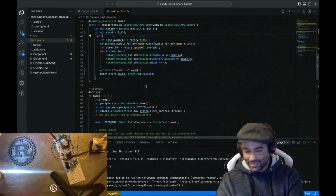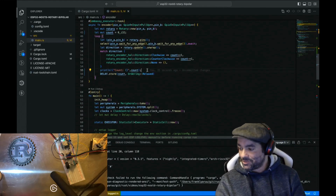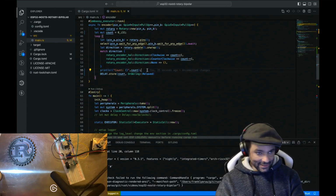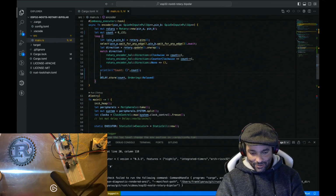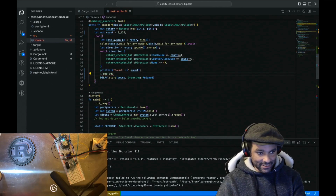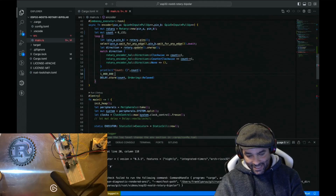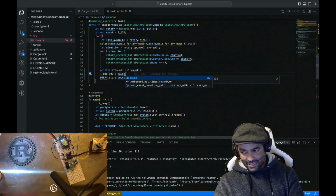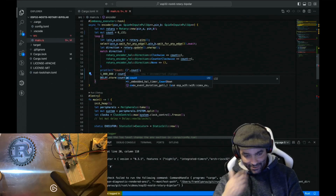So we might need to do some pre-processing here. And I prefer to do it on this side because otherwise every pulse of the motor will recalculate it. Right? So what I would like to do is something like this. I would take like a big number, let's say 1 million. We are all talking microseconds now. And I'm gonna divide it by the count. So something like that. That kind of does work up to a point, but the resolution is pretty well, it takes a lot of turning to get anywhere.